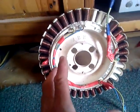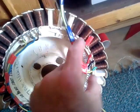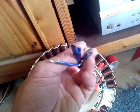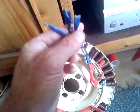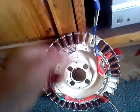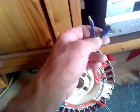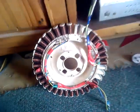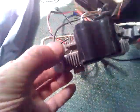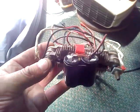So just if this helps you, my buddy out there that's willing to learn this, that's 6, right? That's 6. That generates 24 to 36 volts power out of their AC, and then, you know, you tune it back to DC by one-way blocking diodes or a bridge rectifier. And not a 2-pin bridge rectifier, a 3-pin bridge rectifier. And if you look inside an alternator, as you looked at my other videos, guys, I have ones here that I showed in my last video that I actually hooked up 2 more capacitors to hold power specifically for charging purposes.